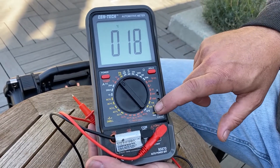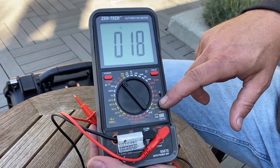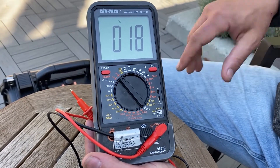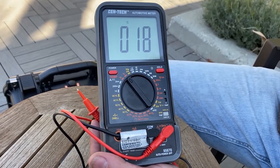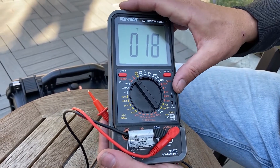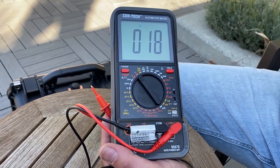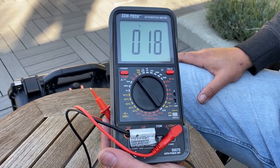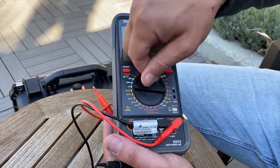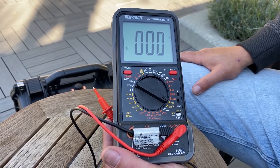As far as voltage goes, you'll be in this range here — up to 200 volts. If you're testing on like 120, I usually put it in the 750 slot and you have plenty of room there. You also have milliamps over here, up to a thousand milliamps which would be one amp. This meter actually tests transistors too — you can put your transistors in there and it'll test them. It also comes with a clamp amp meter.